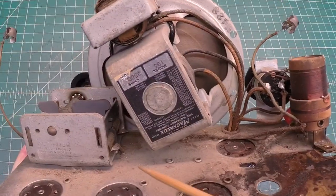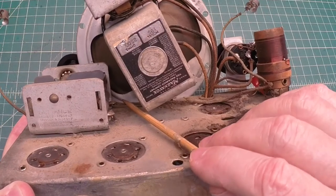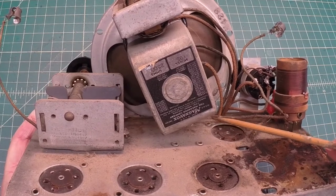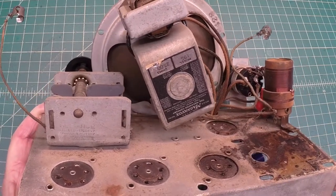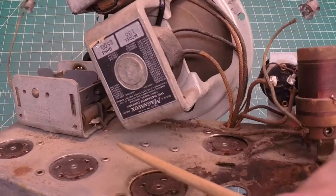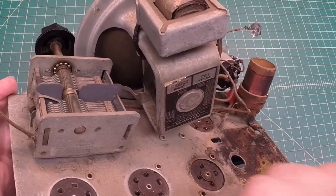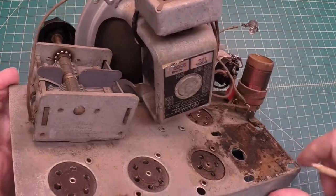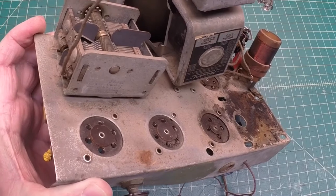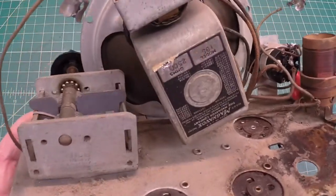You can see our connection points here. There's one lead on the back side of the tuning condenser running across the chassis itself, and it attaches here to the first RF coil. The second connection, closest to us, comes from underneath the chassis. And this third connection point goes back to the grid cap on the 57 tube in here. Let's see what holds this thing in and get it removed.